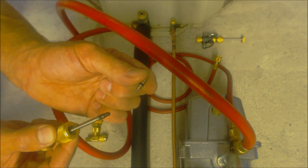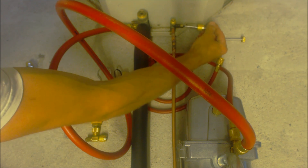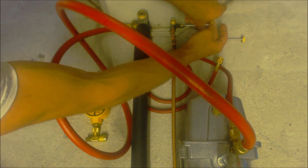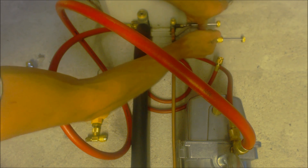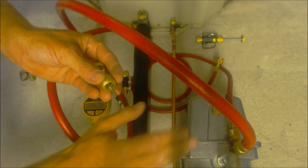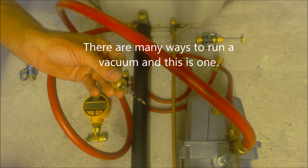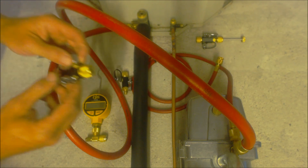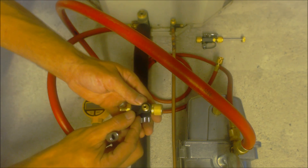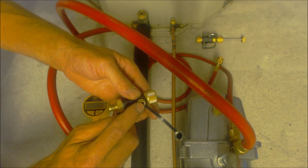There it is. I'm going to pull that off and put it in the valve cap. Now what we're going to do is put these valve cores back in after we get our vacuum done, and after we break the vacuum with refrigerant. This is the way that I like to do it. A little dab of refrigerant oil doesn't hurt on your grommets. On this one, I make sure that this does not have a valve core in the side. So there's no valve core here and no valve core here.